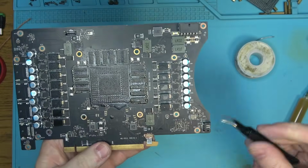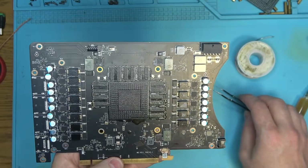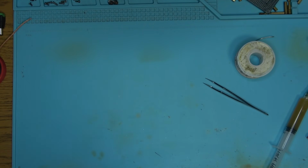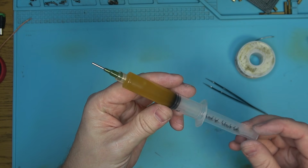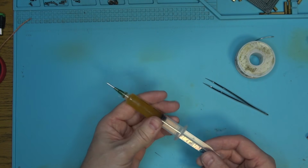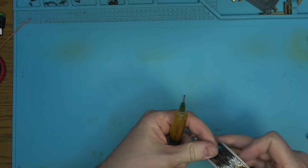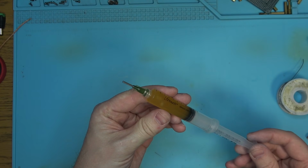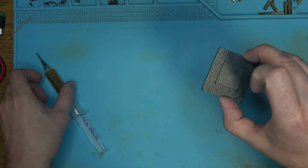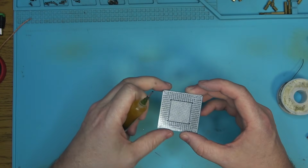I would think that with the MOSFET, it would be just as good as anything. So, I could probably try, but it's just going to be a waste of time. Doesn't matter. I think this thing is more for a general type of use, soldering. Maybe you can use it to remove the cores and whatnot, to do basically all sorts of dirty work. But I would not recommend this for any BGA because of the low boiling point and the way it behaves when you apply it on the BGA chip to begin with, how it sticks to it and then becomes hard instantly. That's a big no-no. Absolutely unusable for applying it on the BGA chip.